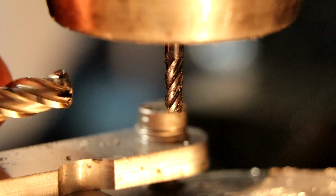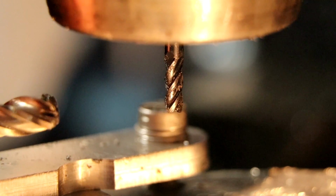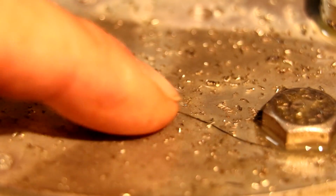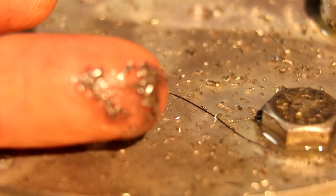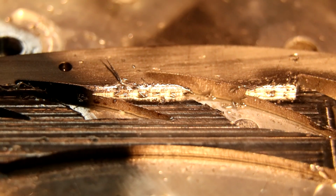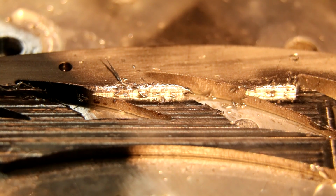So it's not per se the recipe or the depth of cut or the width of cut or the speeds, it's just the cutting tools. The difference between AliExpress carbide and AliExpress HSS steel. Here you can see that it's finally making a chip. It's small, but it's actually doing something, and I had the idea that it was rubbing with the HSS tool. Here's a close-up of the pocket we just milled. It's very close up because I have my zoom lens on, but you can actually see milling lines, and they're straight and flat, and it's just so much better.